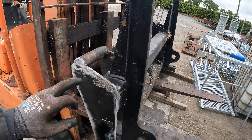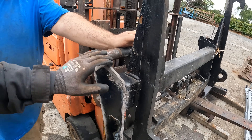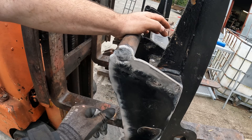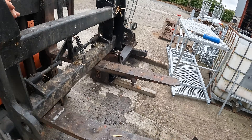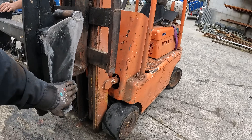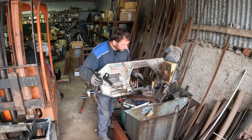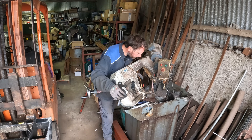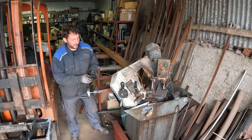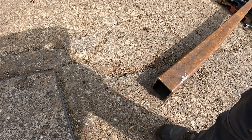You can see what the gas does - it just evaporates the paint off the machine. It does a great job cleaning it off, leaving it a lot easier for welding. It'll reduce the amount of grinder time. It's very fast as well and it kind of brings it back to bare metal. That's pretty heavy stuff - that's surely an eight millimetre wall in that.